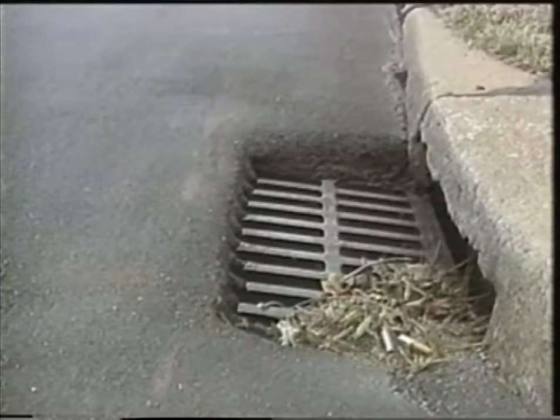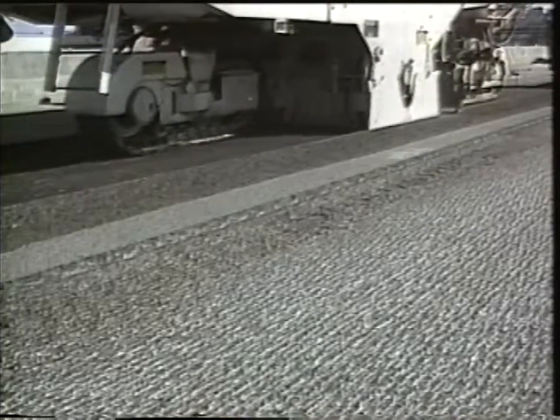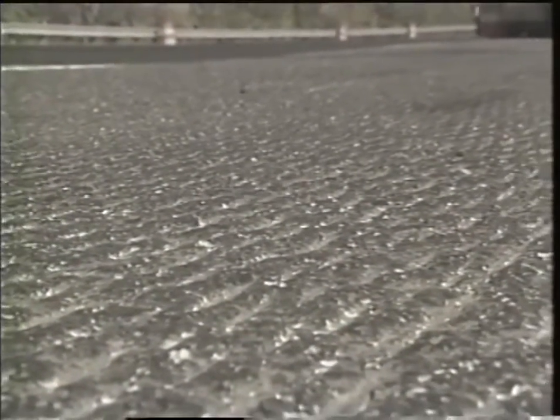After planning comes the second P: preparation — preparing the existing pavement for the overlay. One of the most important considerations at this point is drainage. Rain, snow, and ice are really a pavement's worst enemies. Water can damage both the asphalt and the layers of earth that support it, so engineers design overlays to work as part of the drainage system. Every road is designed to move water away from the pavement — into ditches in rural areas, or through gutters to a storm sewer system in urban areas. A common method used to reshape the old pavement is milling — grinding off some of the existing asphalt — which may be necessary to achieve the right shape for drainage, to lower high spots, or to avoid sharp drop-offs between the pavement edge and the shoulder or gutter.